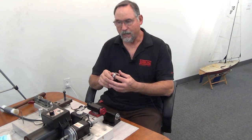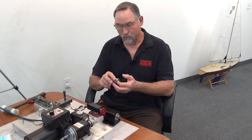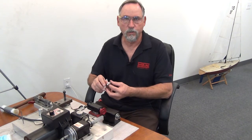We get it down to about two or three tenths. If you get it down to nothing then your bearings are just going to wear out really fast and your headstock's going to run really hot. A lot of our customers will ask if they can just buy the spindle and the bearing and do this at home, and the answer is no, not really. This video is showing you why — this is not what most people have available in their home shop or garage.